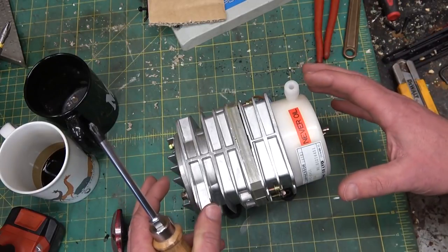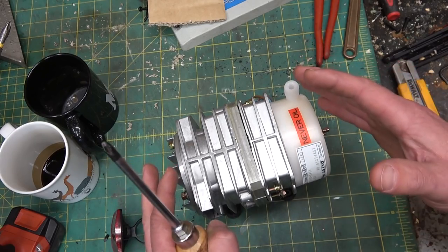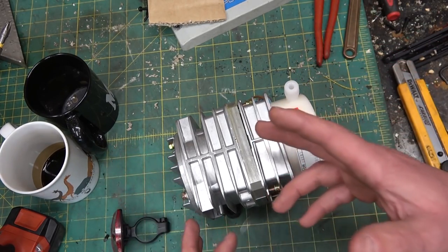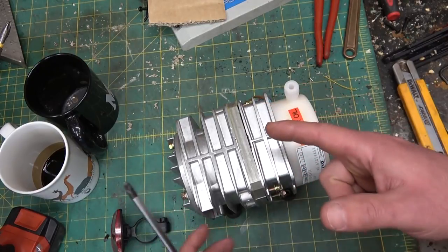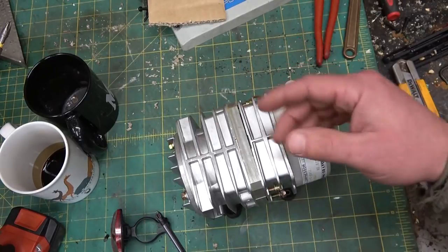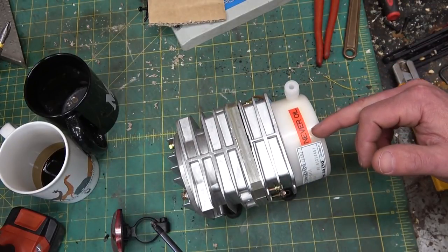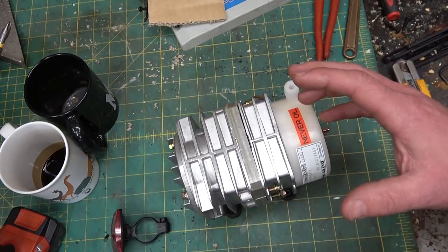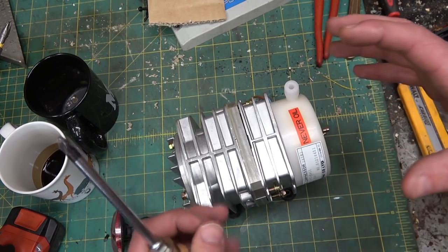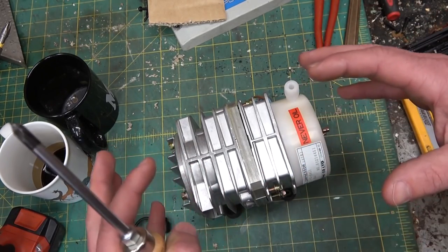A linear compressor is a very interesting device. It is set up for a specific task. It is very high reliability because there's only one moving part — the piston — that reciprocates to and fro. They're extremely robust, but they are suited for purpose. They're specced for purpose. They're not what you would use as an energy source for other tools.